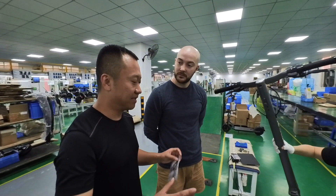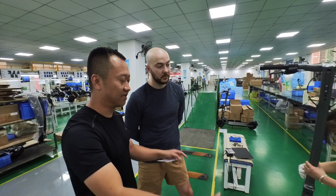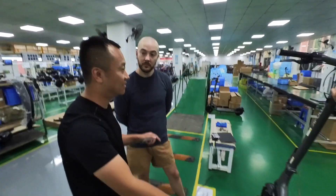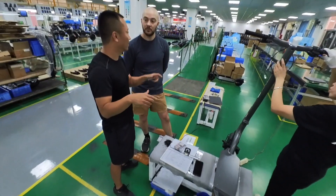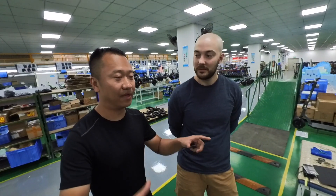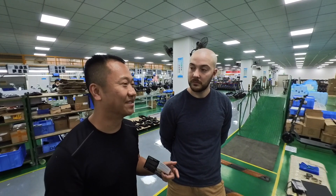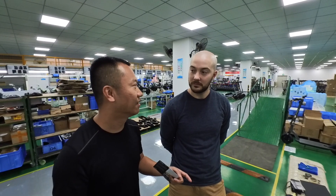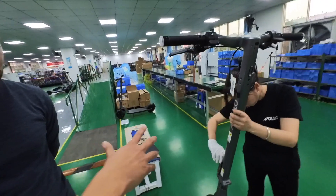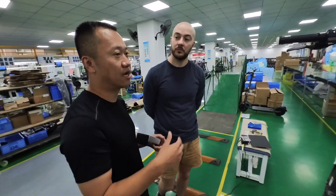Our QC at this spot is 100% inspection, but this is not the last spot. After this, they finish inspecting the scooter, put it over there waiting for the packaging area, clean the scooter, put on the mats, and then we do another random selection inspection. I pick a random selection and make a report based on the number of defects found. This year that percentage is close to 1%. After that, we put it on the packaging line and our team inspects one more time, checking the cosmetics again to make sure nothing's wrong with the scooter.